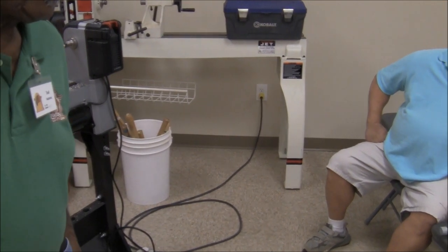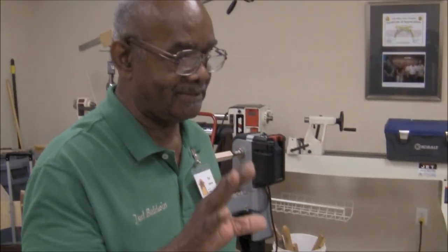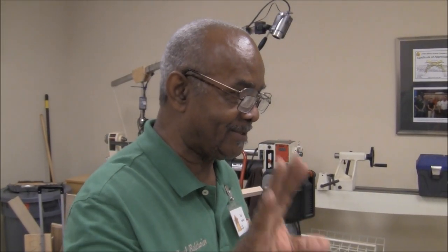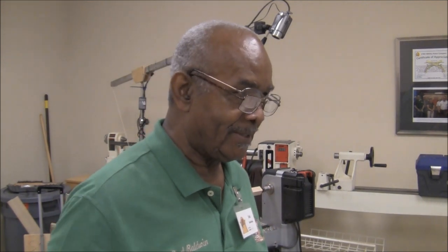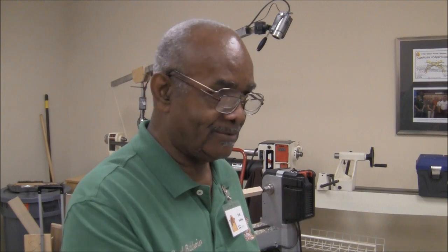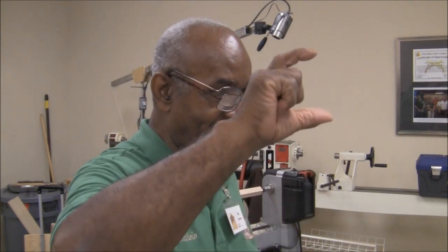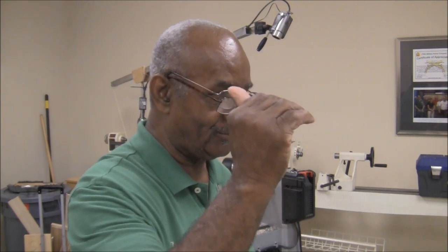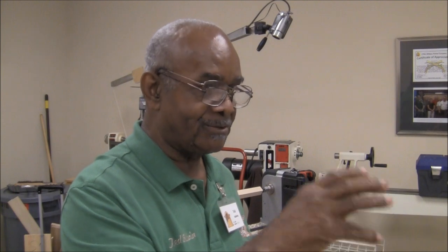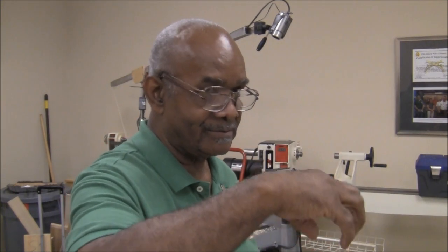It's up to you as to what you want to do. But I've got a friend of mine named David McDonald that does finishing. It took him a long time to convince me not to sand past 180 grit on most stuff I do. You learn how to finish the finish and not the wood. You're not getting the wood as smooth as you want, but the higher grit you sand to, the more you're closing up the pores on the wood, so your finish is just sitting on top. Your finish needs to be able to lock into the wood fibers.